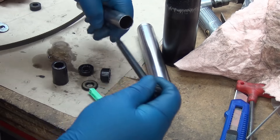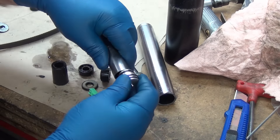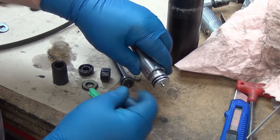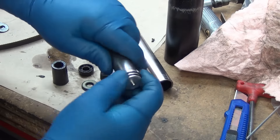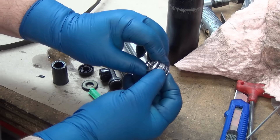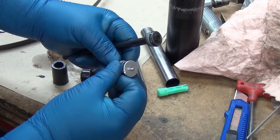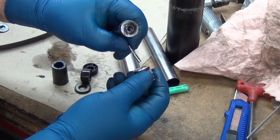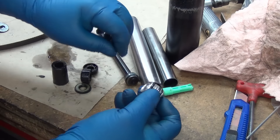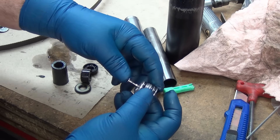I figured out the valve here. The piston is inside the little tube there. This sealed to the end of the little tube, and then the outer one sealed to the inside of the big tube. There is a hole here, and what it does is when you push the green button in, it pushes this little plunger down. The valve is right there — see the smaller diameter? When it's all the way in, it's not sealing at the metal; it's sealing above and below that small spot in the rubber inside, in the o-rings.